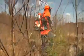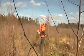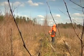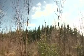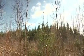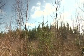The backpack chainsaw's design enables higher stump heights to be achieved. Stump heights can be varied with the aid of the flexible line supporting the drive shaft. When spacing operations are carried out in stages, the stump height should be selected so that the operator can step over these on the second cleaning. A higher stump does not create any direct problems itself and will rot and decompose with time.